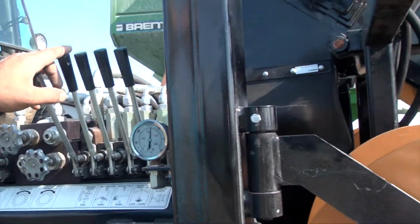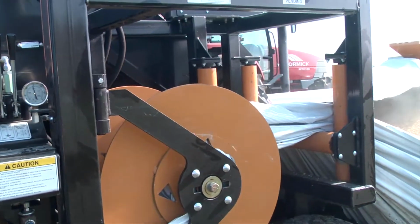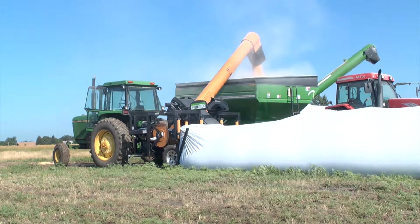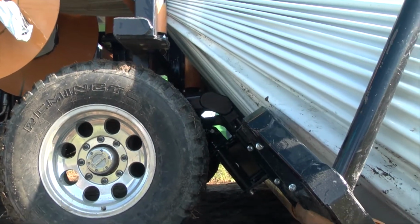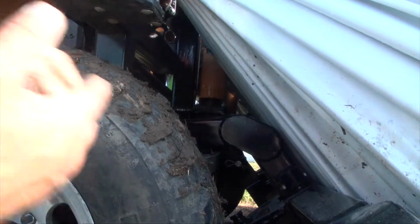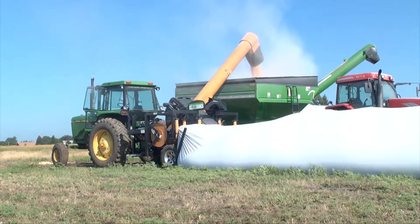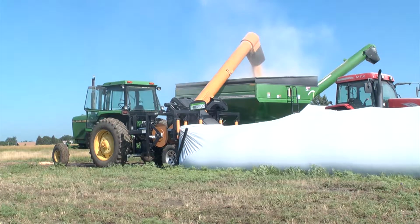With the lockout wheel hubs completely disengaged, start the winders and leave them running. Running the tractor about 450 to 470 RPMs is typically ideal. As the unloader slowly moves back, check to make sure the bottom knife starts. If it doesn't start, you may have a double layer of plastic bunched up, or you may need to replace your knife.